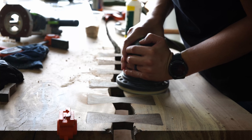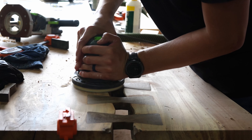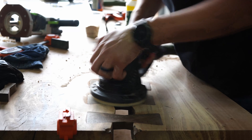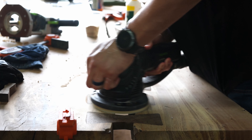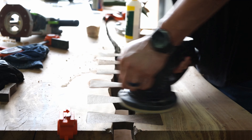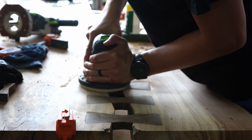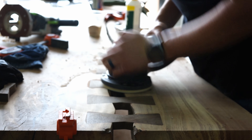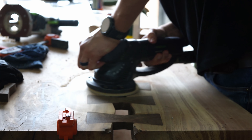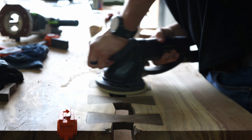To make sure the bow ties sit flush with the tabletop, I took out my Festool Rotex in rotex mode with 80 grit sandpaper. This made the job really easy and fast — it took a total of about five minutes to remove that one millimeter of material, and the bow ties now sit absolutely flush.